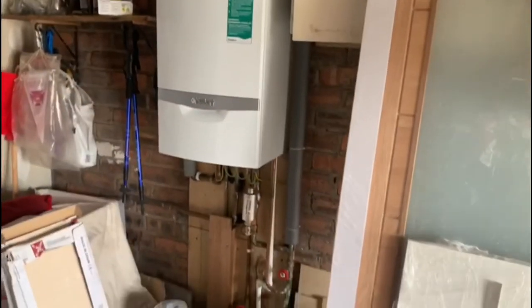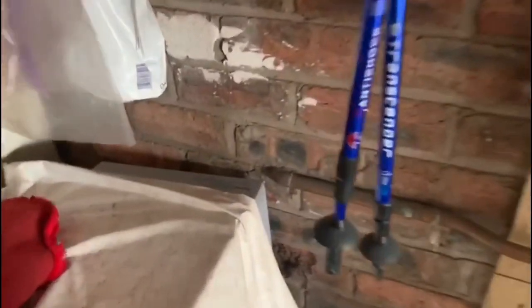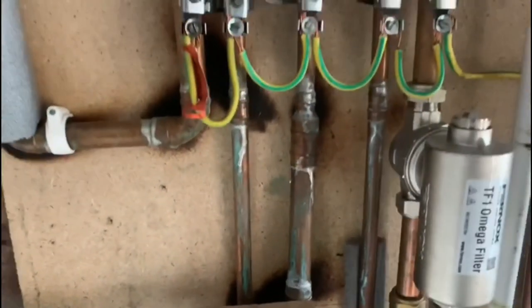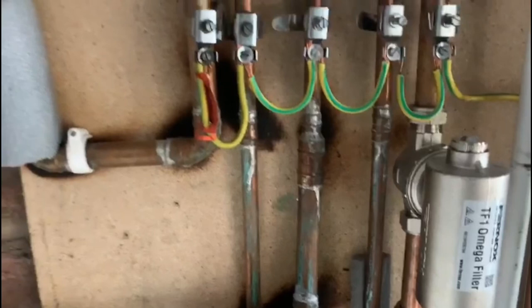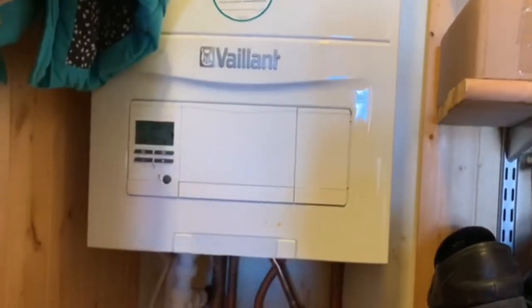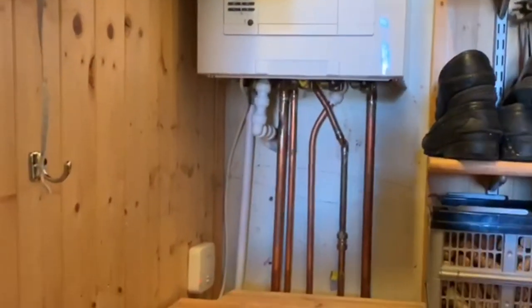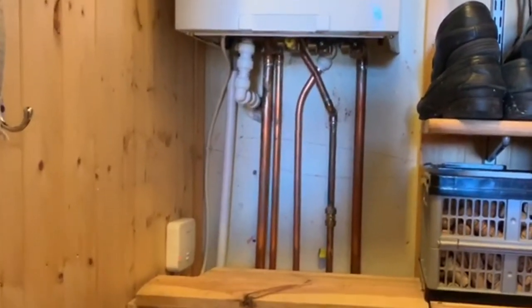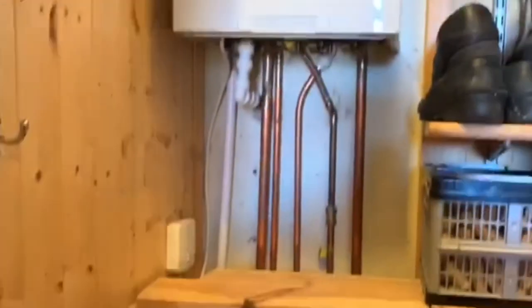What I'll do now is go over these - I've just got a few videos from subscribers. This one's been sent in from a subscriber showing that the gas is not sleeved, a good one for the trainees. It's also showing the pipework and how it's all scorched - a good one for trainees to show to use your heat mats when you're soldering. And this one's just showing no clips on gas, and also it's got push-fit pipe connected directly onto the boiler as well.